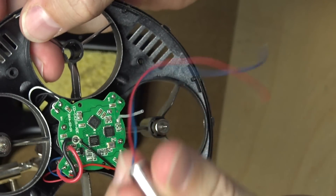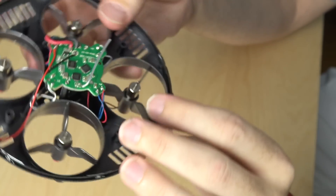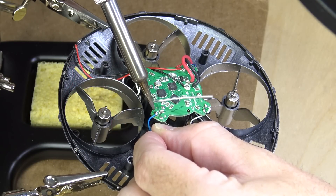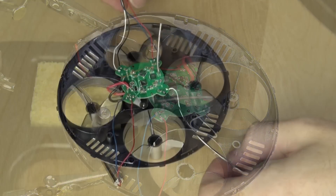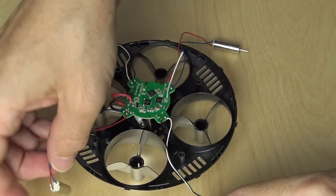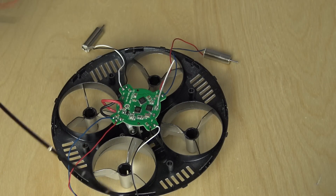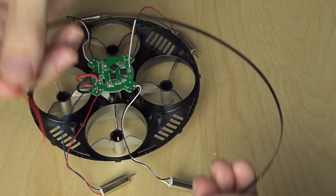The reason I had to do all this is because the wiring for the motors actually goes down below the frame, up through a small channel, back into the body — a really weird design. So I went ahead and re-soldered it back to the board, making sure to put the wires back exactly where they're supposed to be, doing them just one at a time. And while I was at it, I heated up the solder and removed the LEDs that go around the UFO canopy, which gives you an extra set of LEDs just in case.